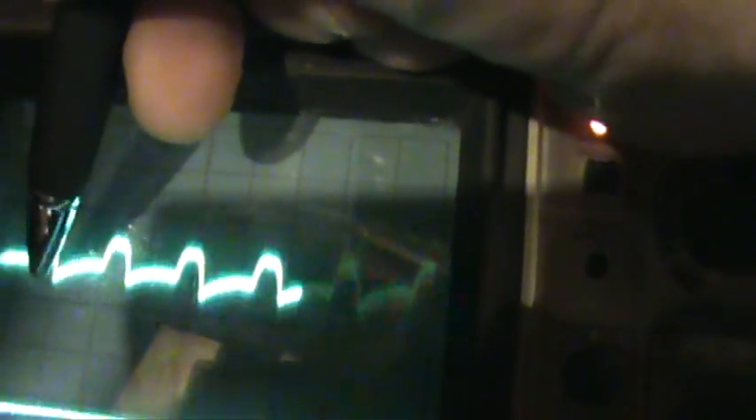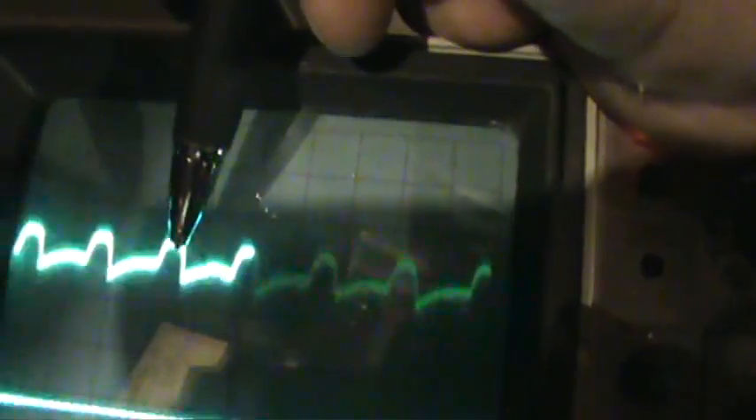The signal is about 170-something millivolts, and the negative side doesn't go as far as the positive. By measuring from one negative to the same negative peak, I calculated it at 119 to 120 hertz. If you just measure negative to negative the short way, you get 60 Hz. So it's a 60-cycle or 120-cycle hum — that's the noise. I'm going to show you how to get rid of it really fast.